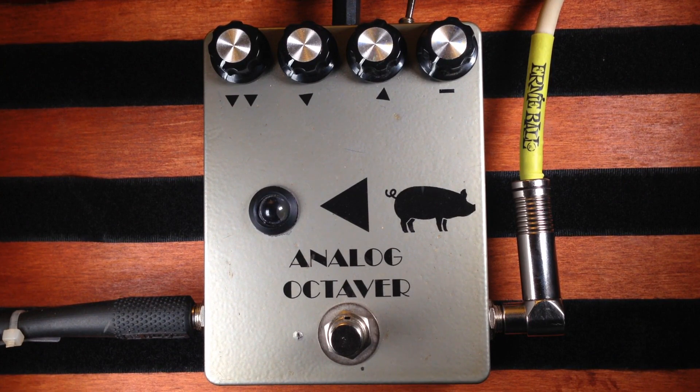There's also a switch, which I initially forgot about so I had to find a somewhat odd spot for it up top. The switch enables a low-pass filter to the signal going to the upper octave. What this does is it simulates you rolling down your guitar's tone knob, which helps with the tracking of the upper octave, as these effects traditionally work best playing with the neck pickup around the 12th fret with the tone rolled down.